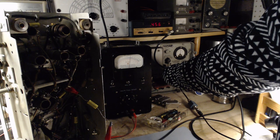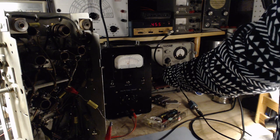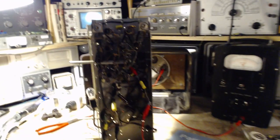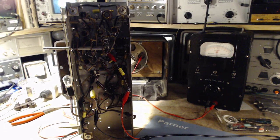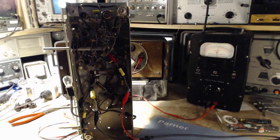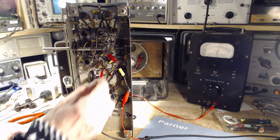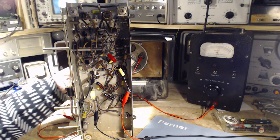What I can't tell from doing this test is, is every coil, there's four coils involved in two transformers, are they all in the right place? I mean, their collective result is a peak at 457. Tool, a little bit of light, so I know what I'm doing. So we want to start now with the second transformer, which I'm pretty sure is going to be this one. And the instructions say top, then bottom, at least they list it that way.